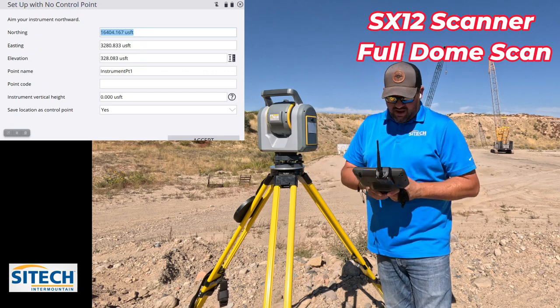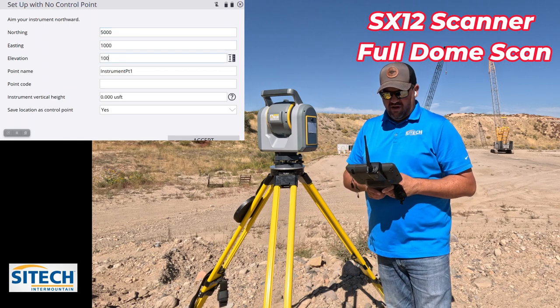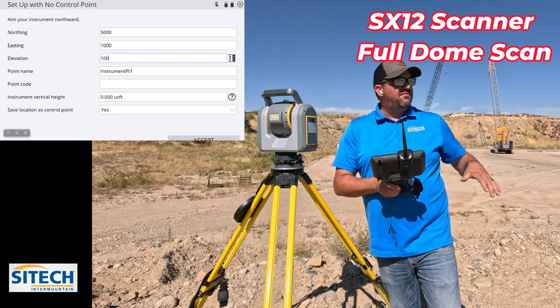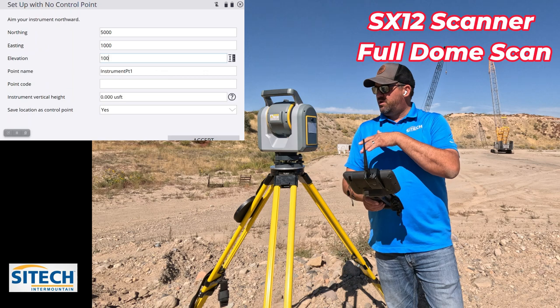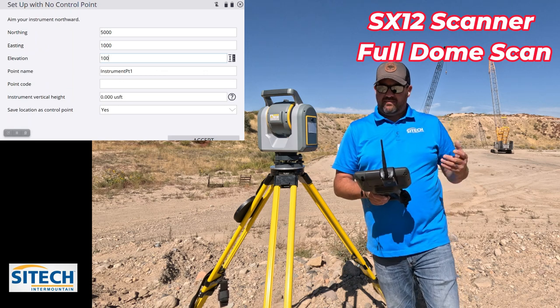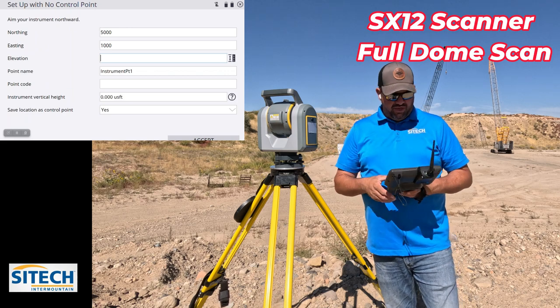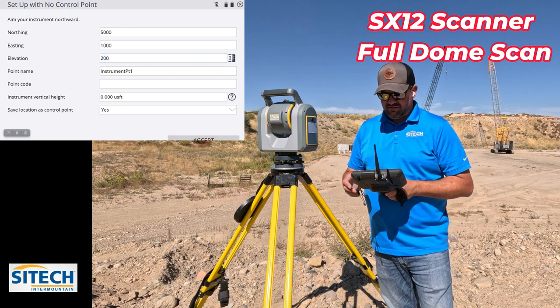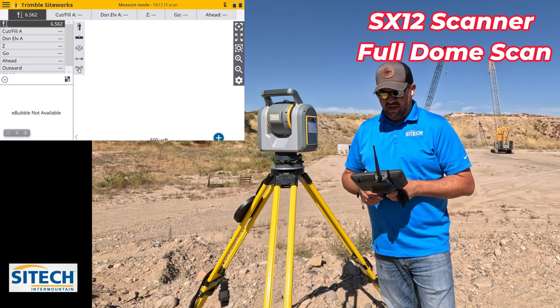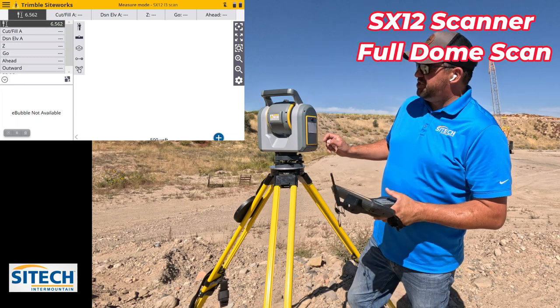When I actually do the setup, I have a habit of doing 5,000 and 1,000 and 100 on the elevation. But keep in mind, if there's anything you're going to scan that you think is below 100 feet or whatever you've set in there, maybe make that a little bit more. So in this case, because it's a little deeper over there, I'm going to go 200 for the elevation. I'm going to hit accept. And we're in.